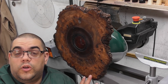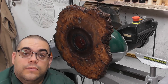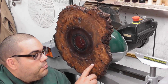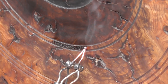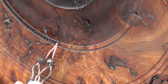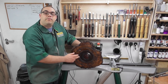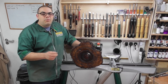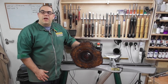Several days later and the oil is now fully cured. I've given it a buff off with the non-woven pad just to get rid of any high spots or bits of excess oil that may have remained. Now I'm going to apply some pyrography — I'm going to use a ball-ended tip in my pyrography pen to put some little dimples on the inside of these rings. With the pyrography rings now complete — I've put one on the outside and one just on the outside of the centre recess — it is now complete. All that's left is to take it off the lathe and deal with the back, just a small infill with some sawdust and sand it back. A small brass hook, maybe on a stand, depending on how somebody wants to use it.